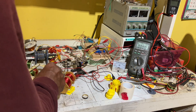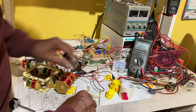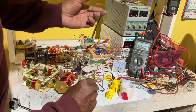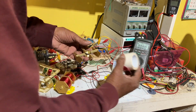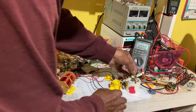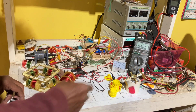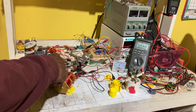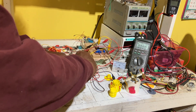This is the holder — this is what goes in there. It's over 50 thousandths bigger than it needs to be. This is tape that I put on the inside of that. The sphere is in here; it's 19 millimeters, that's 20-50 thousandths over what I need it to be.